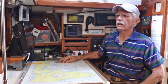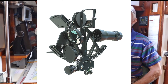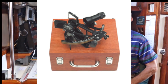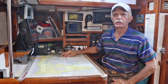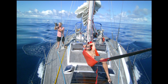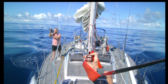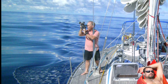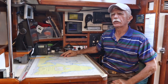You're much better off getting a metal sextant. The only other metal sextant I have used is the Astra 3B, and that's a tremendous upgrade in accuracy over any plastic sextant — it's the difference between a plastic violin and a quality wood violin. Decades ago I did a comparison: the best I could do with the plastic sextant was to get within 4.4 miles of my known position, while with the metal Astra 3B the accuracy was 1.5 miles.